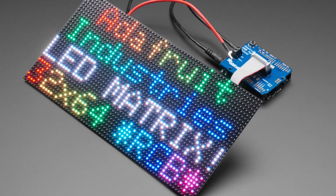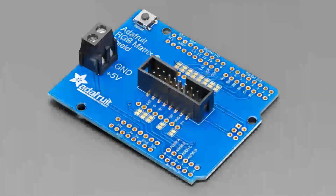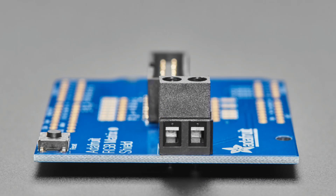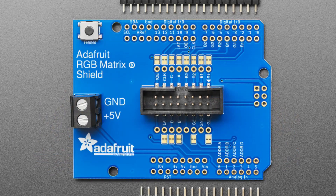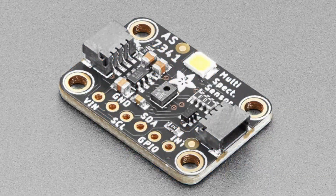We also have another revision for the LED matrix shield that goes on an Arduino. Originally designed for the Arduino Uno or Metro 328, it also works on the Metro M4 and Metro M0. The revision is that it's now partially pre-assembled — the terminal block, 2-by-8 header, and button come pre-soldered. You still need to solder on the header to connect it to an Arduino, but it's a lot less work and you don't have to worry about getting the RGB connector in backwards.